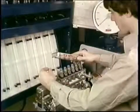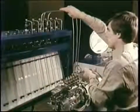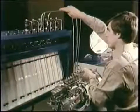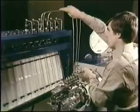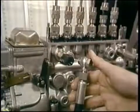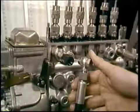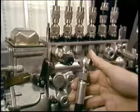Begin by removing this cover unless it was left off in your reassembly. For this application, you're using engine nozzle holders, so you run these test lines right into the tray to start with. When you've connected the feed hose using an adapter like this to match the threads of the pump housing, you've completed your preparation.